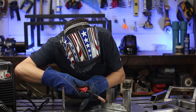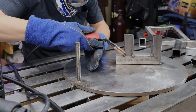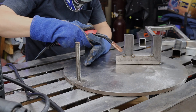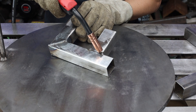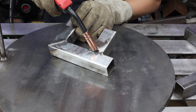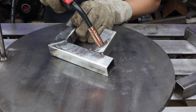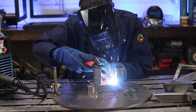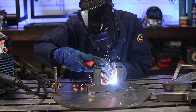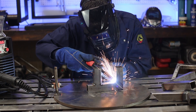Tack weld your piece in the corners. One of the trickiest parts of welding square tubing is how to tie into the other welds — you have to completely reposition yourself to get to the other side. Tacking in the corners allows you to tie into each side without having to reposition. Secondly, for all of those that don't have a nice fixture table, me included, the tack will hold your part in place without having to clamp it down in every direction.